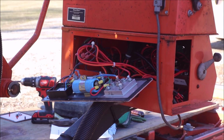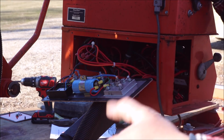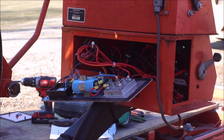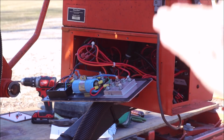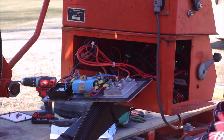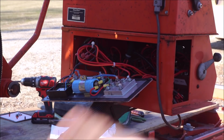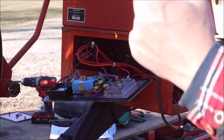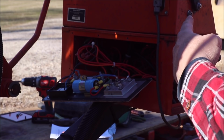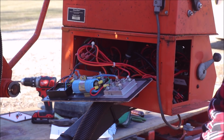And this up here is the AccuSet. AccuSet is the computer program which allows me to preset thicknesses, and literally just one button I press down the handle, the feed down, and it automatically goes to the next board. So if I want to cut 4/4 boards or 6/4 boards or 8/4 boards or whatever sizes I program in, just with one little bop, it'll remember where I was before, regardless of how high I run the mill up. And then when I come back to start the next cut, I hit the down button and it automatically advances down to the next cut.